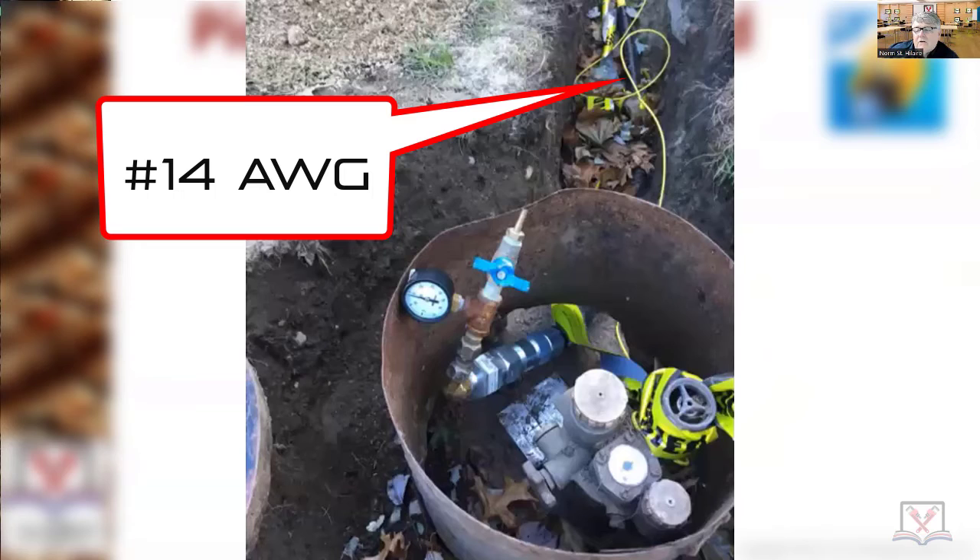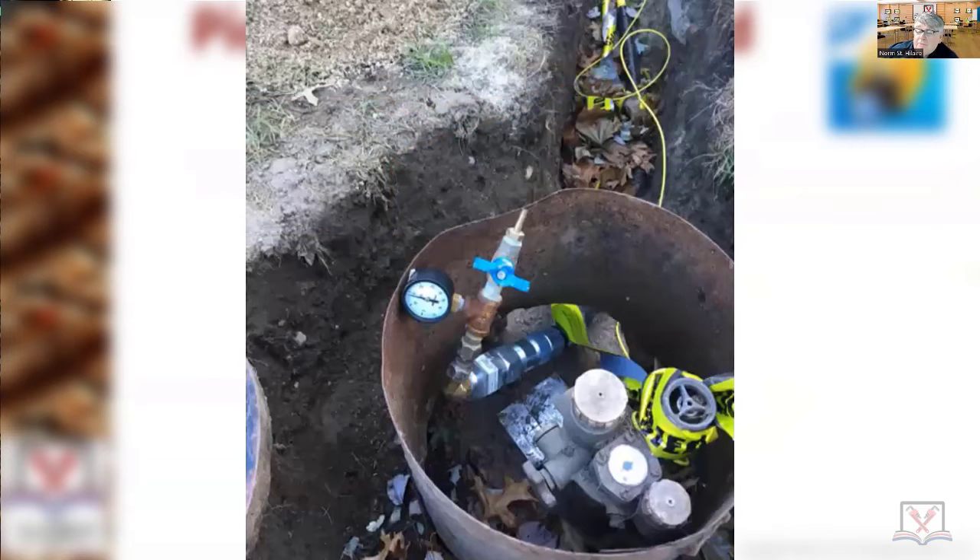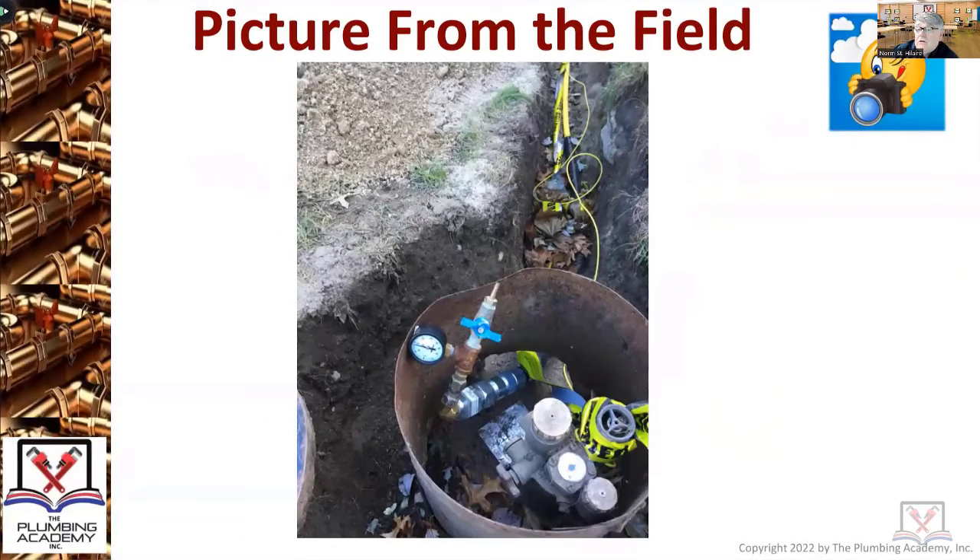It is 14 — that is awesome. It's also showing some tape in the trench. Both tape and tracer wire are not required together — it's one or the other in your code book. If you're going to put tracer wire in a trench when you backfill, that should be right with the pipe, not doing loop-to-loops, because that's how we're going to figure out where the pipe is and where it's going. Good craftspeople and excavators will use the tape about six inches to a foot below grade when they start backfilling, so they know if they hit the tape they're within a foot or six inches of hitting the pipe.